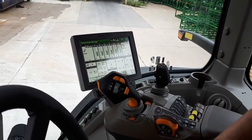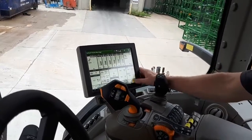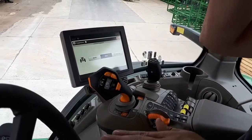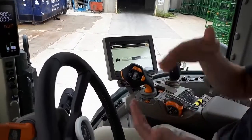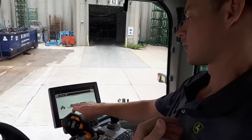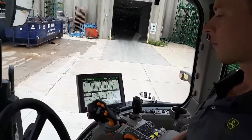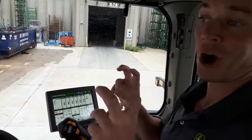So if we had a loader on this tractor, could you lock that so that... Yep, absolutely. The best way to do it is, and I would say if you're going to put a loader on it, you go into our suspension there, and we'll select that max, and all that's going to try to do is it's going to try to hold it at that max suspension for whenever we're rolling into a pile or something along those lines, where you don't really want that give on the front end. Right. For our application for transport and most field applications, we just want to let the software do its job and run that suspension in auto. And then the cab is going to be a mechanical suspension, so it'll essentially be on all the time.